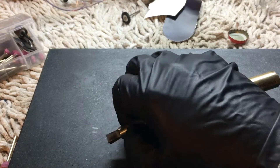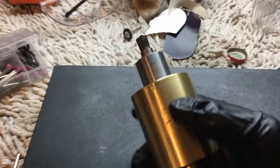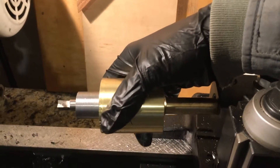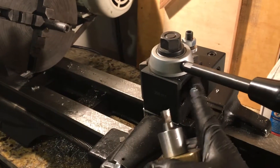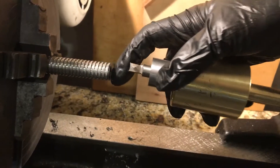And it does actually work. It just slides right into my boring bar holder. I set the compound at one degree, or whatever it works out to, so this is at one degree, and it just spins around and cuts a little square hole.